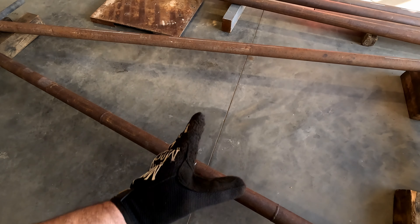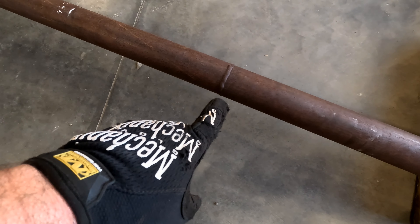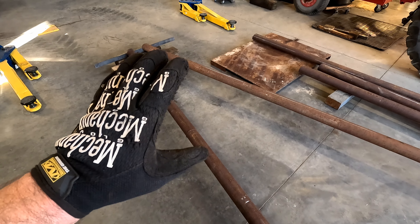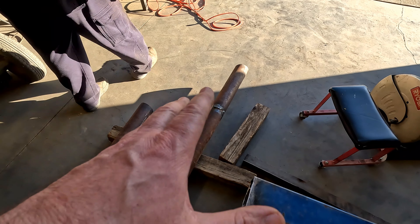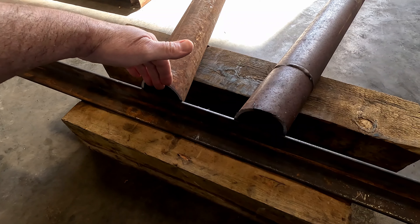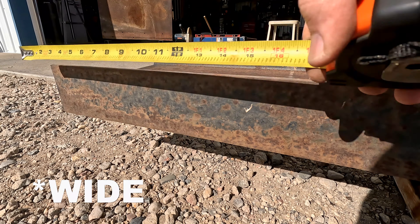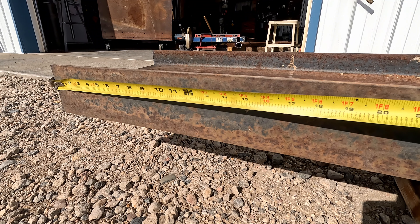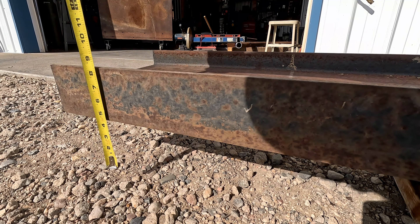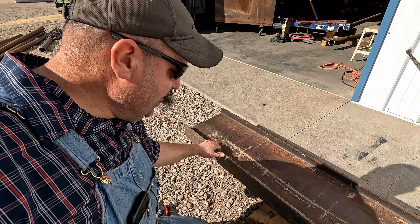We finally landed on 4 foot 6 for our gusset that's going to go across here. We just need to make up just a little bit to get the length we need. These were used to hold up a giant concrete foundation wall that we backfilled, so they're going to hold. Got that tacked — I'm going to burn it in more when we get the buzz box out and assemble everything. When we weld this together we're going to need a plate for these pipes to butt into right underneath the beam. Our beam's about 4 inches wide and we're going to want that plate to come out about 16 or 18 inches, about a foot wide back here, then taper it down to 4 inches — that'll give us enough room to put bolts in and bolt it to the beam.